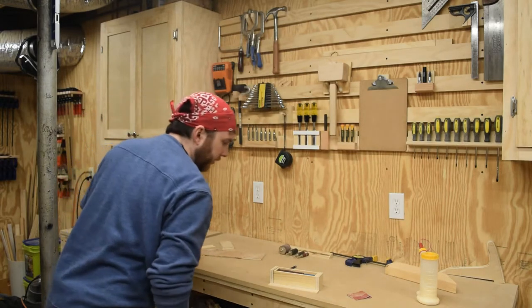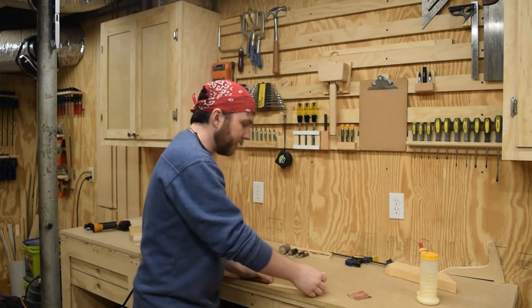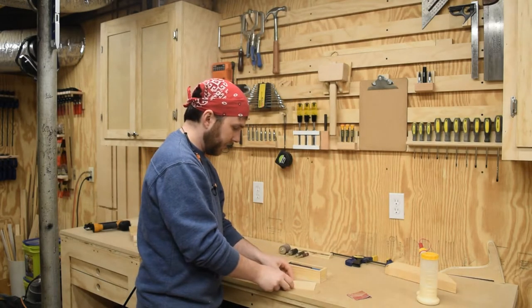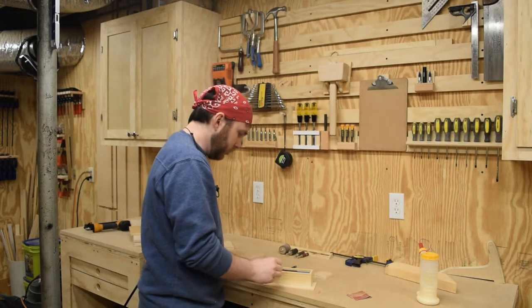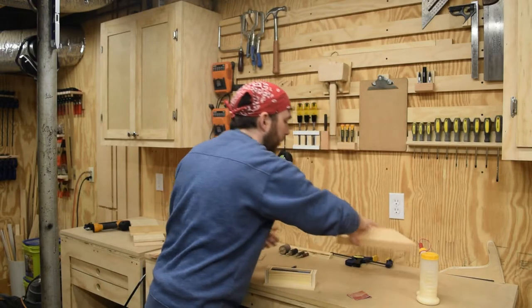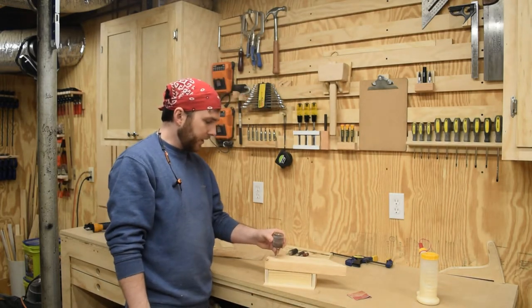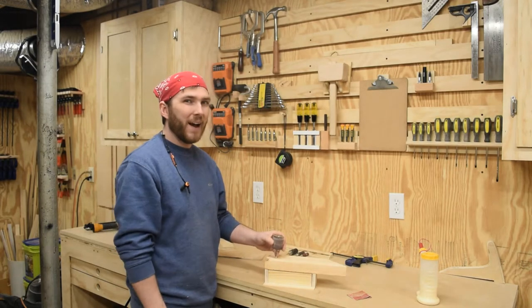Off camera, I cut a few little pieces of half-inch plywood that can act as the sides of the box and I cut down a few thin pieces of scrap that can be the bottom. Next thing to do is to cut down some two by four down to two and a quarter by one inch thick, and that's going to be the top where I'll come back and drill some holes to store the spindles. So back to the table saw.